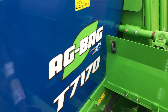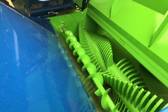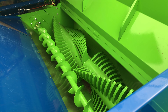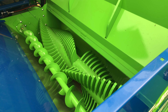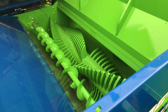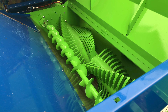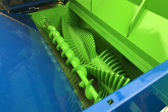One of the main improvements of this machine is what we refer to as a revolutionary rotor. The revolutionary rotor has over double the teeth and now has three rows of tines and tine caps, rather than bunches in groups of two around the perimeter of the rotor. We also have a forage distributor in front of it that has several features to help spread out the crop load across the rotor, to ensure high capacity, prevent bridging, and maintain even crop flow into the bag for consistent packing and better density throughout.